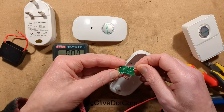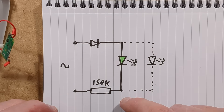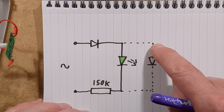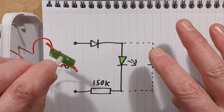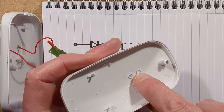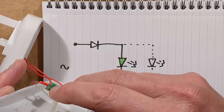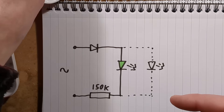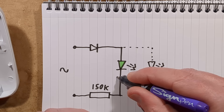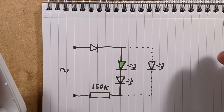The circuitry — oh my god. The circuitry has got safer; it's very universal. It's got a diode, an LED and a resistor, which is actually being used within its specification to a degree because it's only half wave. They've also got the option to have another LED in parallel for those special cases with two LEDs in the front. There's a big plastic sprue and the other position for the second LED if they choose to use it, and they just mount the circuit board vertically, literally just stuffed into the hole. They could have put a little capacitor across for smoothing, and the second LED could have been added for double the brightness with the same component values.